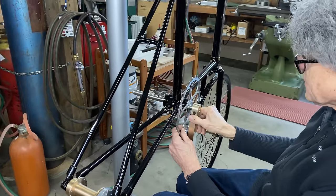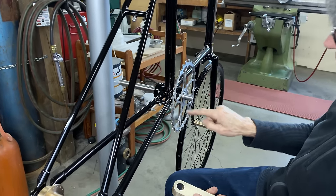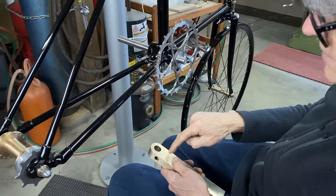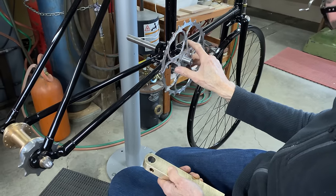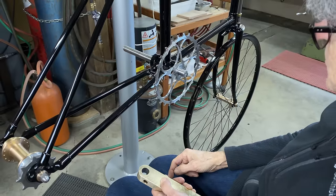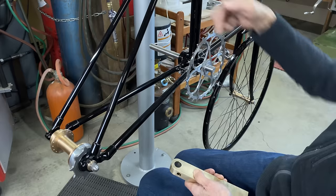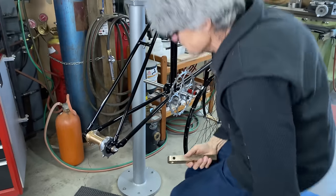And then we have to anchor. I have to drill a hole here because it's got to locate with that, because otherwise this is just going to spin. There has to be some sort of a mechanism that holds this into there. So let's go. Well, what is the next thing to do? I guess the next thing to do is to drill that out and see what size we get that to. And also look at an Allen screw. See what size I'm gonna use. I'm thinking a 6mm would go in there. And it would go in from the back and get hidden. You wouldn't really see that much at all. So that's what we're gonna do.